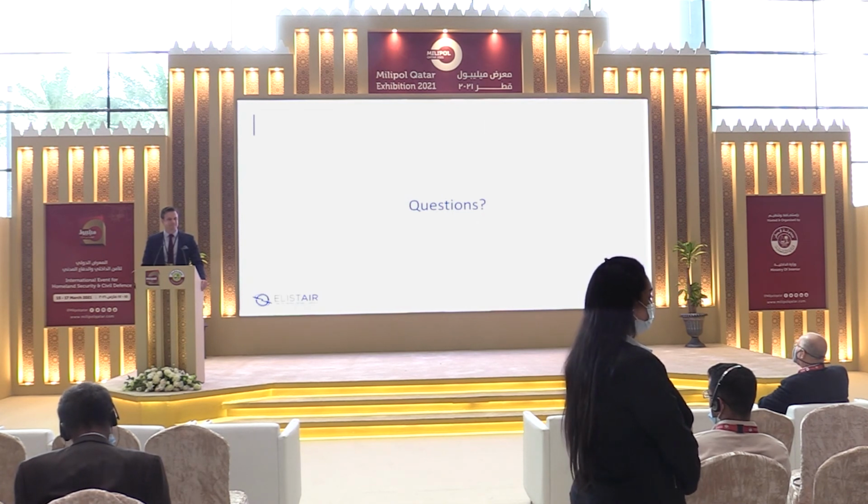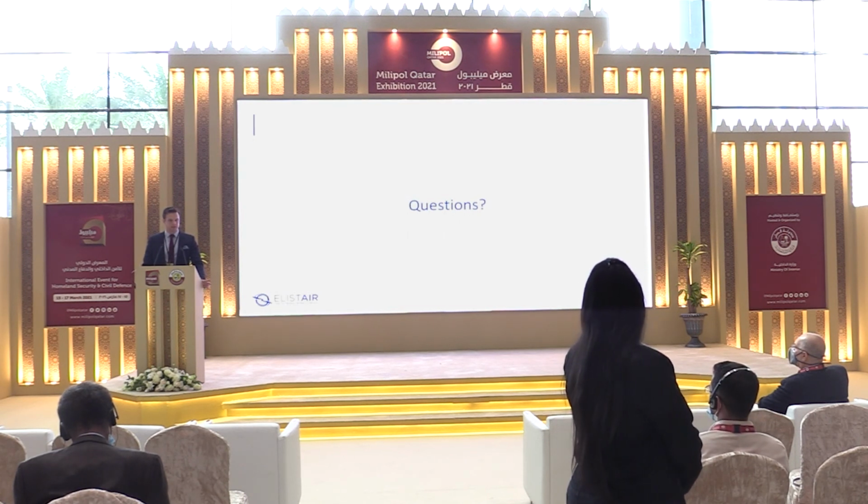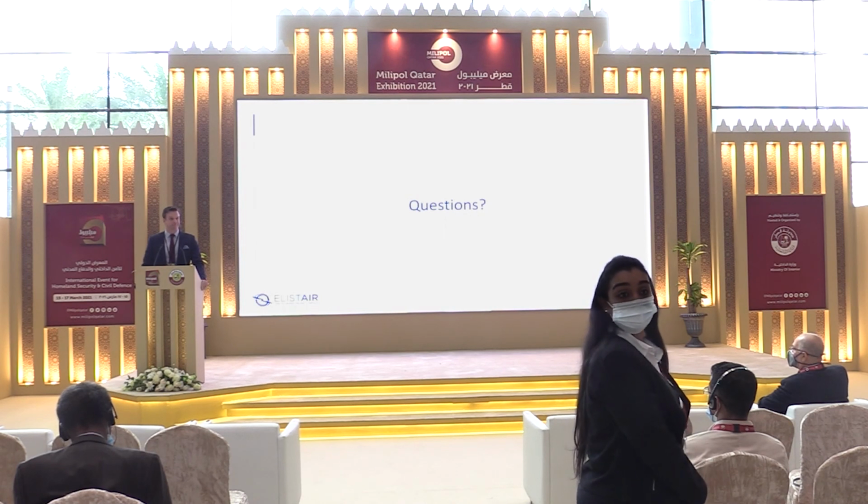So the range of vision would be... It depends on the camera, but out to 10 kilometers is a good indication by day in good weather conditions. With an infrared sensor, we're looking at 2 to 3 kilometers to detect a vehicle, and maybe 1 kilometer to detect a human being.